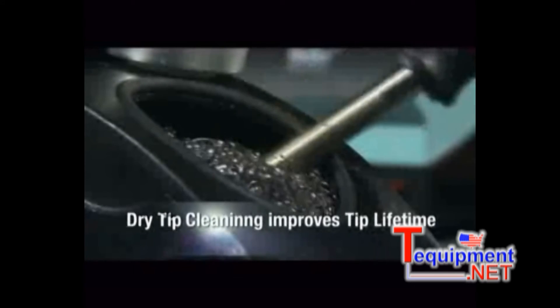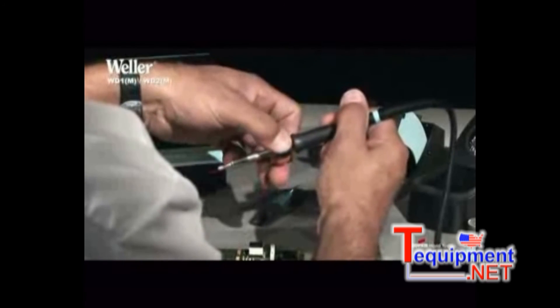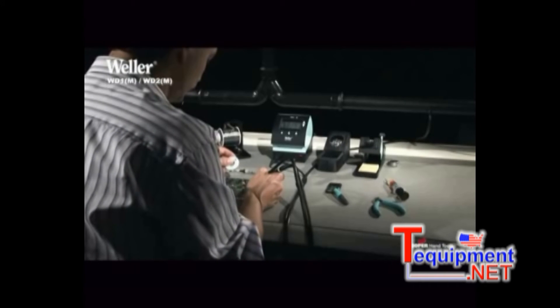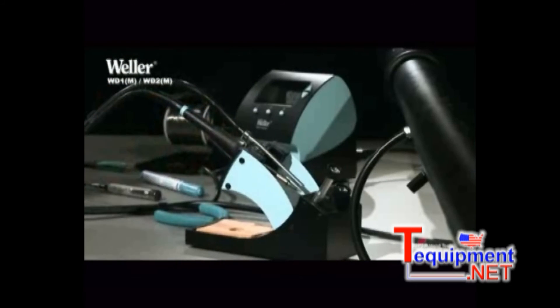The WSP80 was adapted to meet the rapidly increasing demands of electronics manufacturers. As the fastener of the soldering tips can be freely exchanged, the distance to the soldering point can be varied. Thanks to the technical improvements, the handle temperature could be reduced and the working comfort increased. The solder smoke tip suction for use with the WFE devices can of course be retrofitted.